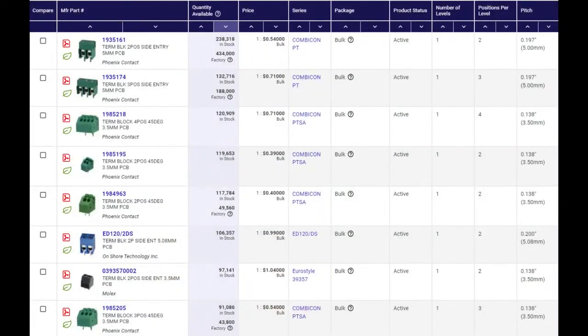So most people are familiar with terminal blocks that look like this. There's little screw terminals at the top and you open them up with a screwdriver and the little mouth opens. You stick the wires in and you close them, and that makes a good mechanical connection without using a specialized cable connector. You might be wondering, why not just use a JST PH or similar wire to board connector that actually has a housing and contacts? Well, those are usually not rated for very high currents. They're not inexpensive, and sometimes they have voltage limitations.